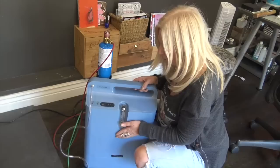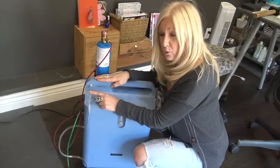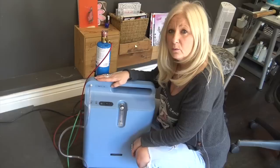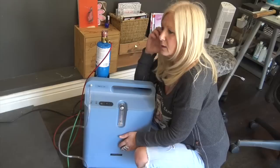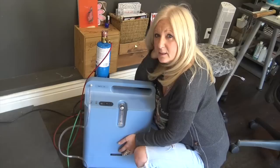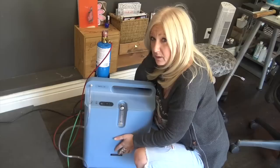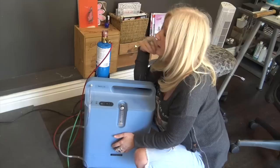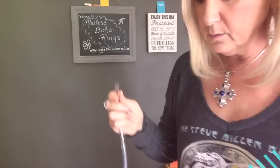Five liters per minute works great; anything stronger is fine too. To hook it up, you need a PVC hose with a quarter-inch diameter and three brass fittings from Air Gas. The reason I'm switching is I want to get rid of my big tanks — both the acetylene and the oxygen — from my studio. I love my Smith Little torch, and if I can work without big tanks I'll be much happier. This is more economical because I don't have to buy oxygen anymore — I only have to replace the little disposable propane tanks.